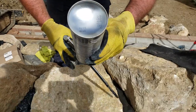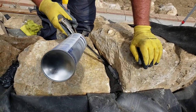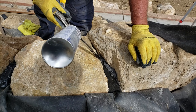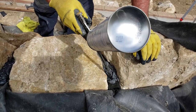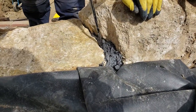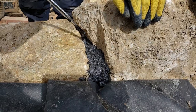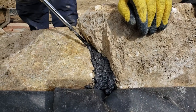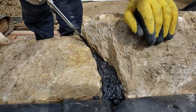Go ahead and check this out — I'm just going to lay down a really nice, easy foam bead inside here. Less is more when you're using waterfall foam because it is going to expand. When I'm done with this area, I'm going to smash it into place a little bit, add some gravel into this area, and maybe give it a little shot inside this hole right over here.